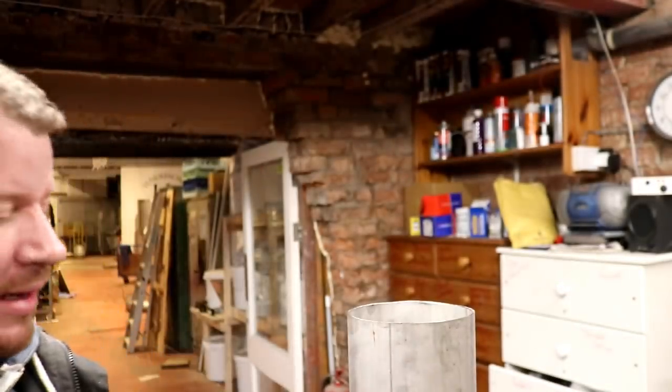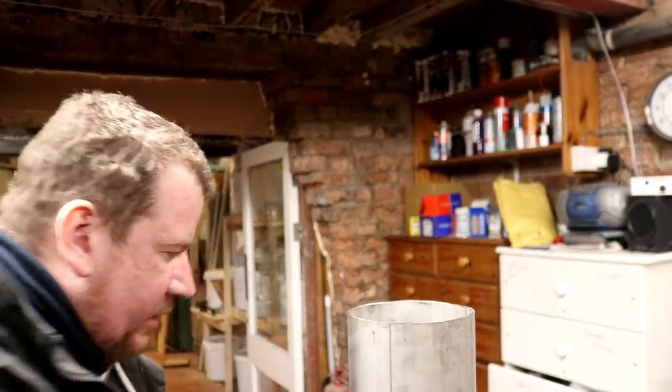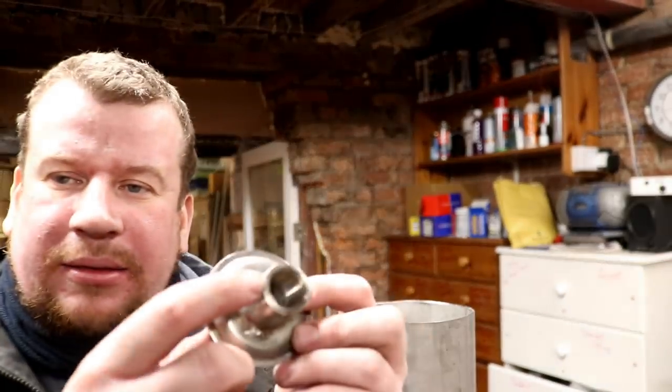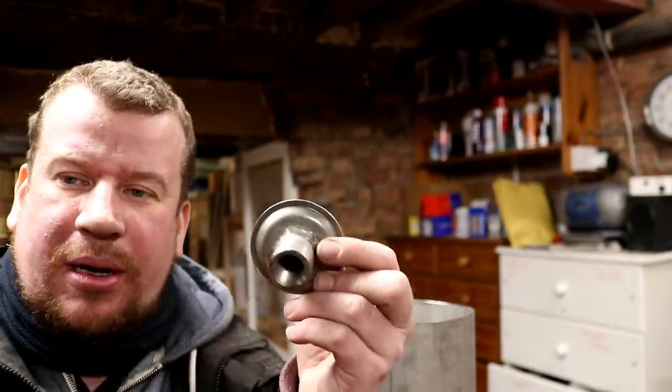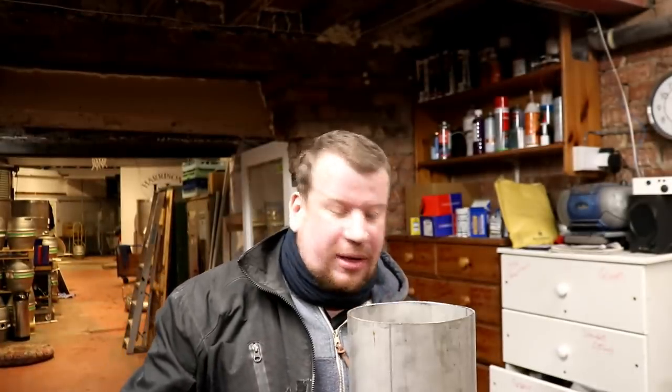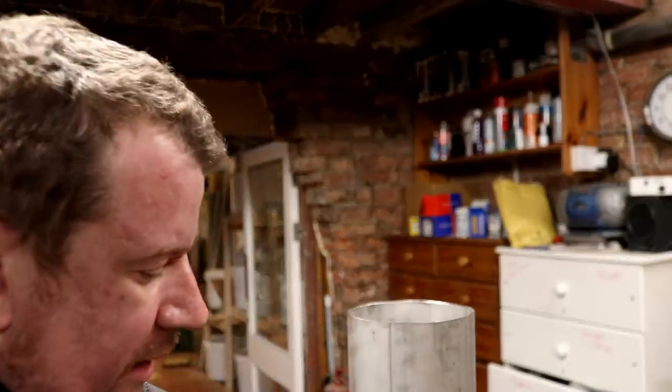and then when we come to take it to duct the waste away, I can just insert something like this with a 3/4-inch pipe on there, and then we'll just pipe. In fact, I think just like a 15mm pipe will do it, but I'll put 3/4-inch pipe on there and pipe it out to waste. And yeah, that will get rid of the water that we condense back from the boil.